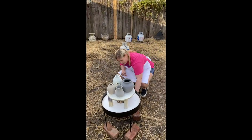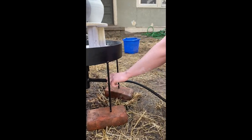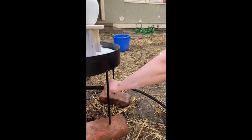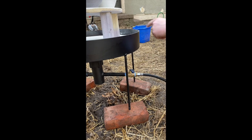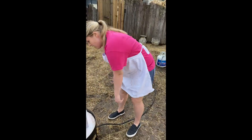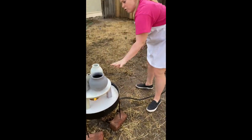Down here I have a little lever that lets me turn on the gas. One thing you never want to do is turn this all the way up, because it's going to release a lot of propane and blow back in your face. So I'm going to turn this towards myself. You can hear the propane running. I'm going to back it down just a little bit now that the flame has caught, and I'm just going to let this whole thing warm up a bit so I don't shock the pots and crack them.